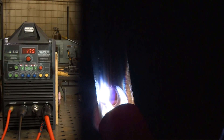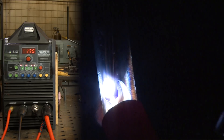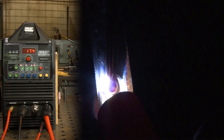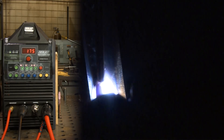I am using all of it now. I'm just trying to get a good little fill pass over this so that when I run my next pass in with low hydrogen 7018 stick, I don't rearrange that root. Trying to go just outside the toe of the weld, spend some time out on the bevel face, get some fill in here.